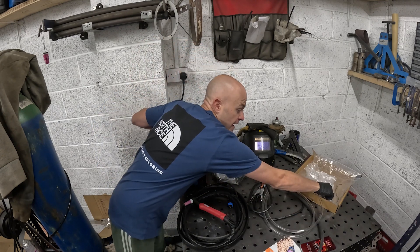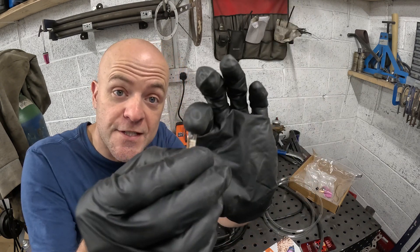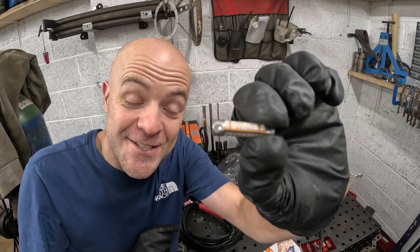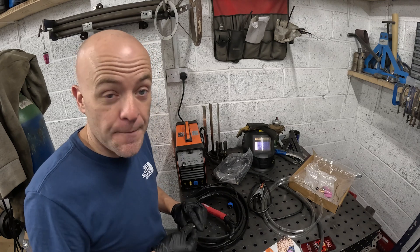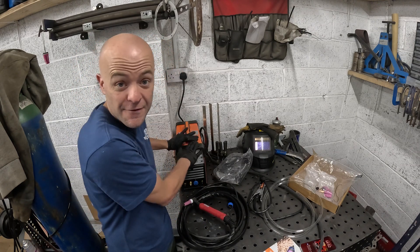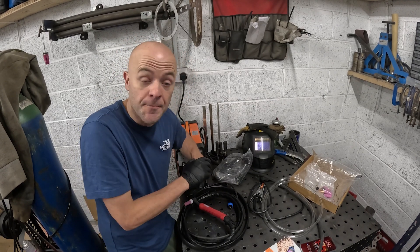You need to remove the plug fuse because they're putting links across the fuses themselves. That is a 13 amp fuse with a solid metal link across it, soldered at both ends, so that fuse isn't doing anything. There's no excuse not to change it — you can get 10 fuses for about £2 at the shop. Make sure you change it before even plugging it in because if there's a massive fault and you haven't got good electrics at home it could be a potential fire hazard.